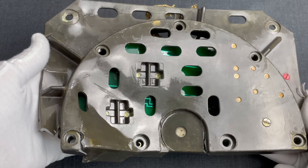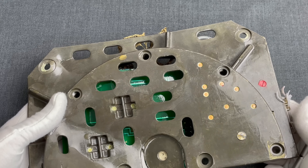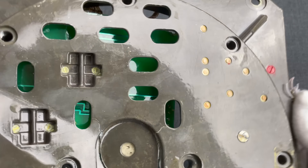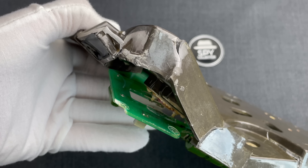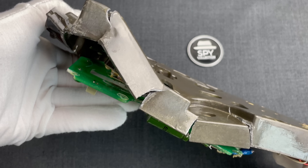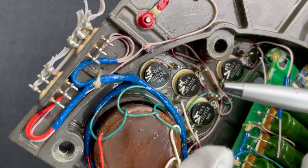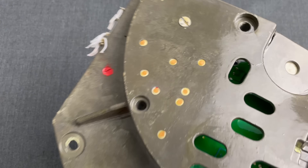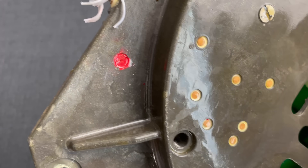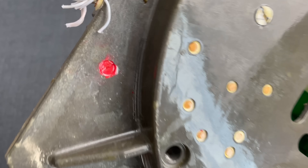Just a disclaimer — we are no Russian missile experts, so any additional information is highly appreciated. As you can see, its metal body was violently deformed due to the impact, but we can hopefully still deduce some information from it. Firstly, we have this simple cable connector here, where one of its cables leads to this. And if we flip it, we'll see that this is visible from the external side too, with this red-coated screw — likely some sort of ground or connectivity testing point.